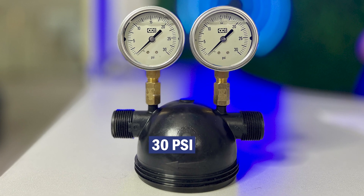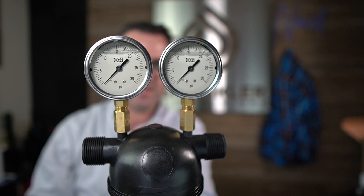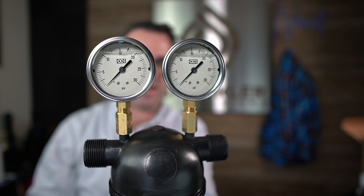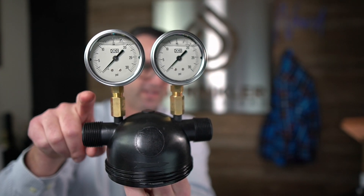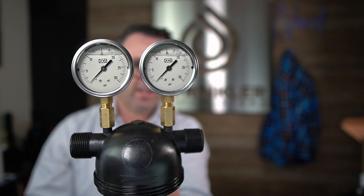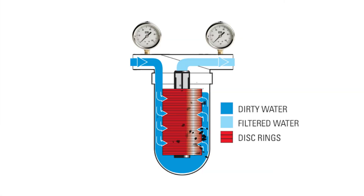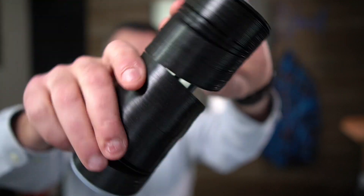In this example I had 30 psi pressure regulators in our warehouse. Depending on the pressure you're running, you might need to read pressure at a greater value. On the upstream side you might be looking for 10 psi more than the downstream side, and if you do see that kind of pressure differential then you will know that there is debris in your filter. Here's a close-up of the disc filter — you will know there's debris in here, and all you have to do is unscrew the cap, shake it off in a bucket of water, use a soft bristle brush if you need to, to clean off the discs, and then install it again.